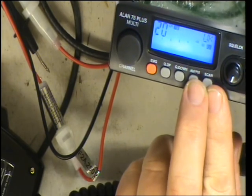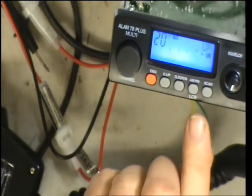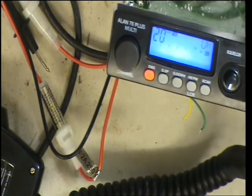So it's: hold those two, switch it on, and when it boots up rotate the channel selector until you get the country you want, and lock it in with AM/FM. That'll save you reading the instruction manual which you've already lost.